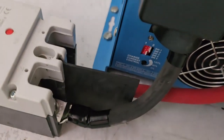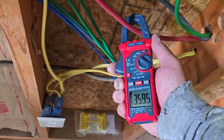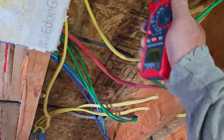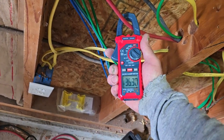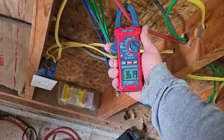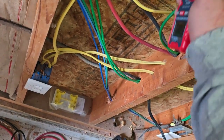I just turned the dial up all the way for the charger. Now we are pulling 33 amps off of that side and 35 off of that. So it should probably be 33 and 33. So 32 and 32 or something on the house running — that would be 64 amps charging. Up here we've got 9 amps in the house going, so we actually have 14 amps in the house running. We're not actually pulling that much for the charger. So taking 9 off of 35, that's about 25 amps for the charger — about 20 amps on full blast.